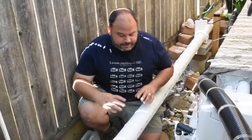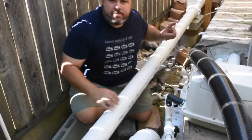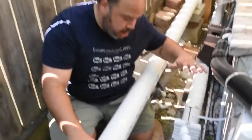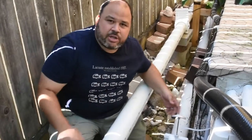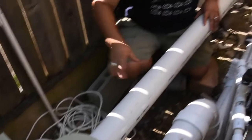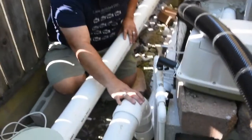We're on the inlet side of the filter. Basically we have a four-inch pipe coming from the bottom drains in the pond, controlled by this gate valve. You always want a gate valve before the filter because when you need to service it, you just shut this down and disconnect it — no problem. The other four-inch pipe comes from the skimmer. This filter, as small as it is, handles almost five thousand gallons but is rated up to eight thousand gallons, fed by these two four-inch pipes.